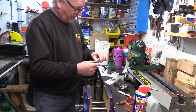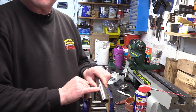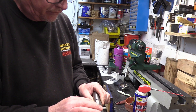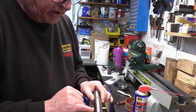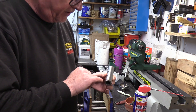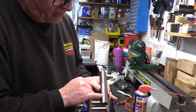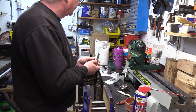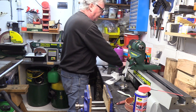What I particularly want to pay attention to is the actual keyways themselves. You've got two obviously — one's the lock and one's your anti-rotation one. Just make sure these are nice and clean. Where the lock's been going on, you've got metal on metal on there, so just make sure that's got no bruising or pickups in there. You can give that a little trim.